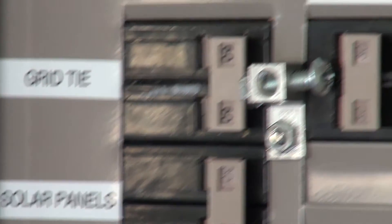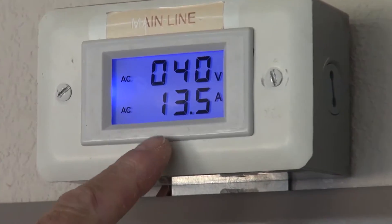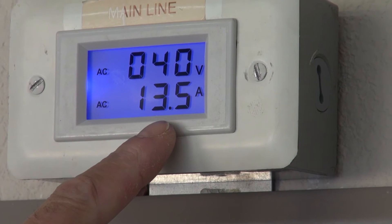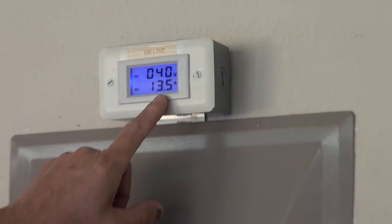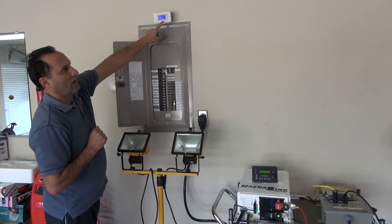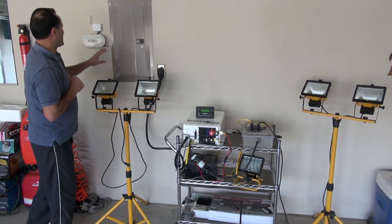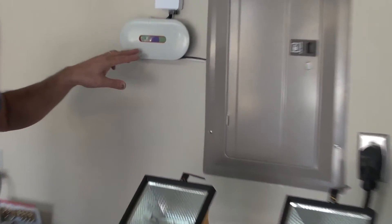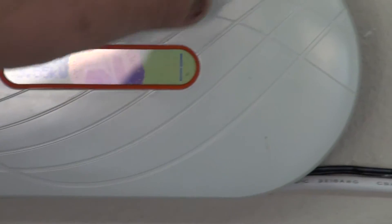As you can see right now, I installed this meter on top. It shows 40 but it's supposed to show 240 — something is wrong with the first digit. It's 240 volts and my solar panels are generating 13.5 amps. Right now it's about a quarter to four in Austin, Texas — today I think is January 17. So at almost four o'clock in the afternoon we are generating 13.5 amps. This is the Enphase Envoy — it shows currently I'm generating 3.55 kilowatts. I use this little router to transmit the information from the Envoy to my main router so I can access it anywhere in the world.